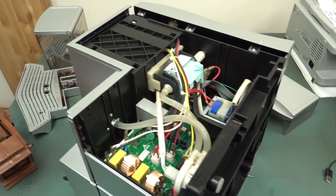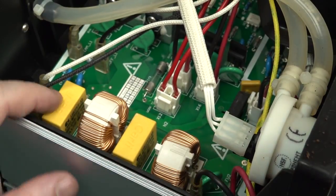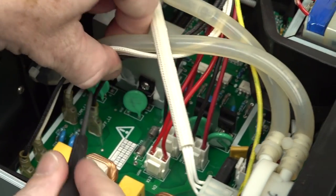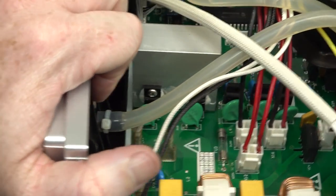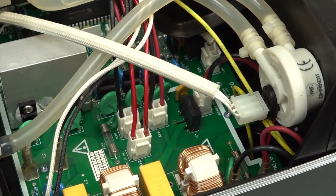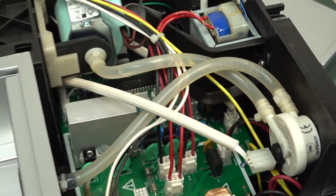If we take that side lid off — check out inside here. This is pretty jazzy. There are input chokes, all very nice. You can salvage those, salvage your input caps. It's all very nice. We've got a whole bunch of MOVs down there — one, two, three, four, five. There's a PTC over there, our bridge rectifier, and some sort of pump thing happening here. Once again, you could salvage all those.